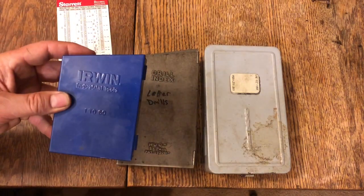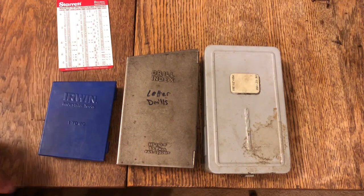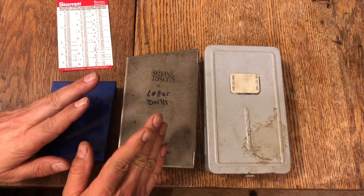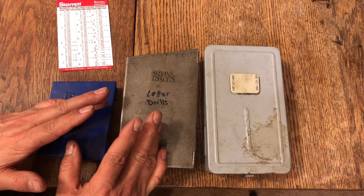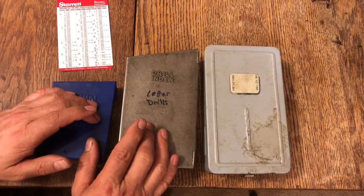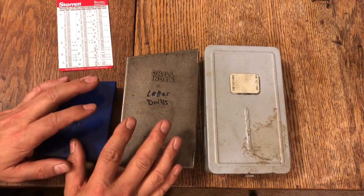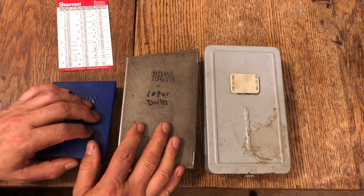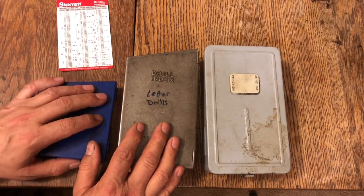So you would say, well, that's 3 thousandths over. That's pretty big. When you're putting pins in a knife handle, that's not that big, because typically your holes might be misaligned by 1/1000th of an inch or something. It went wonky when you were center punching, or maybe when you were transferring your holes, or however you're putting your handle together. It's nice to have a little bit of flexible room. So 3 thousandths of an inch is perfect.